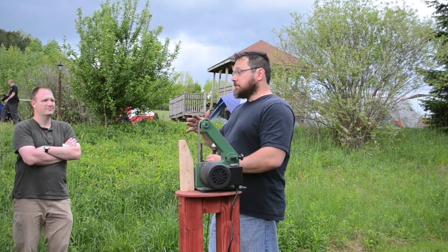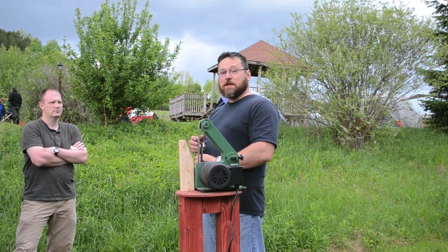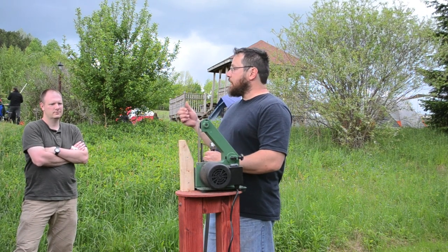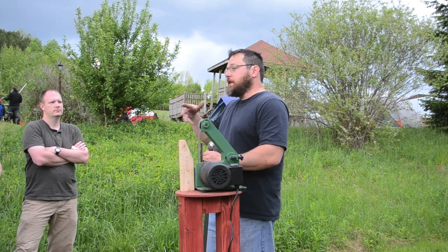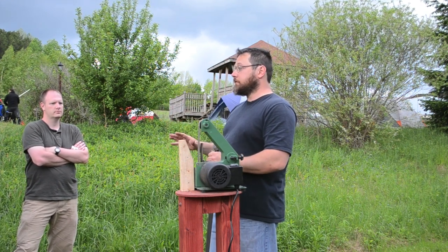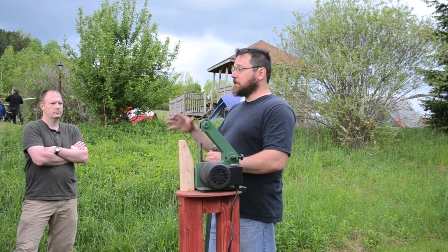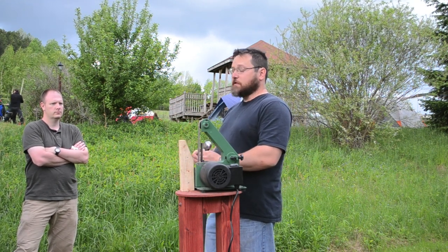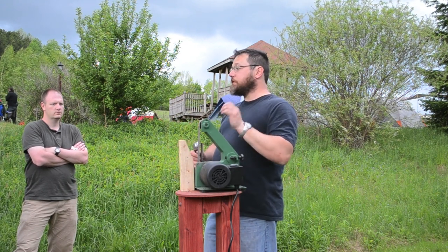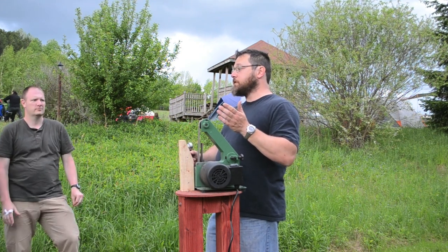The new Albions? Sometimes yes, sometimes no, sometimes on one side but not the other. If it doesn't have a 40-degree bevel, you have to create one. Start with your coarsest grit belt — if the sword is already fairly sharp and close to a 40-degree bevel, 240 is good. If 240 doesn't do anything, start with 80. You never want to go lower than 80.